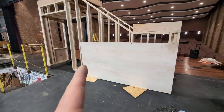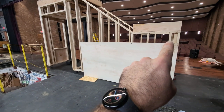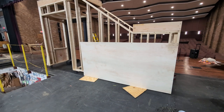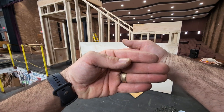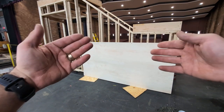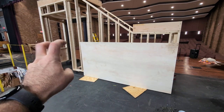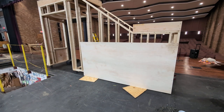Well, you notice that the end of my sheet didn't work out on the stud, because my layout actually starts here, which is the nature of this small cavity between the second last stud and the last stud. So this needs to be taken apart, and we need to send the sheet to this end. I had been thinking that I would do it opposite on both sides and make up the piece opposite, but it wasn't framed opposite. It was framed as a mirror image, and both sheets are going to want to start at this door alcove opening and go this way, and the small piece is left to make it up on the other side. So it's part of having your head in the game, and nothing that won't take a minute or two here, but once we're on the right track, we want to stay on the right track.